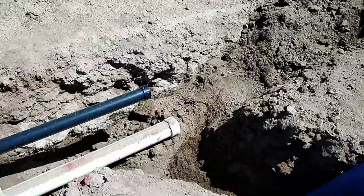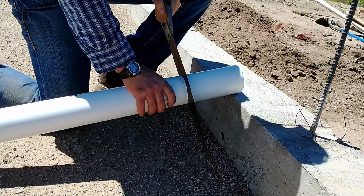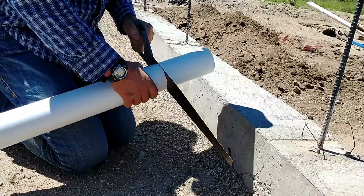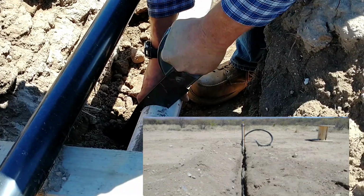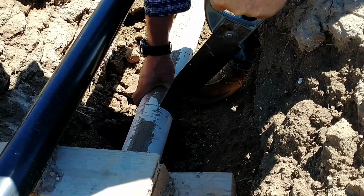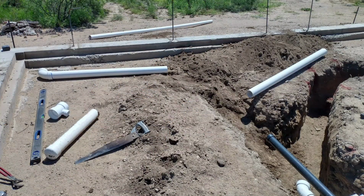We decided to build a temporary bathroom structure on the location just for convenience. So we'd have one out there and easy access. It was convenient because we already had the septic system completed, so we decided to plumb it right into our existing septic system. And we also have water on the location. It's stubbed up, and it'd be easy to tie in, so we decided to make a fully functional bathroom with a flushing toilet and sink, and actually put it located on the pad in the exact location that one of the toilets is planned to be.